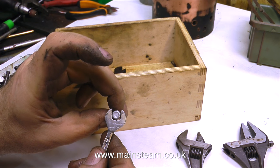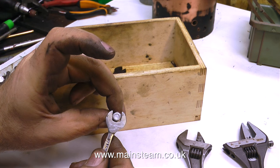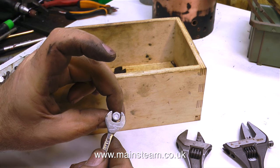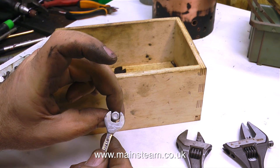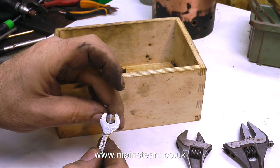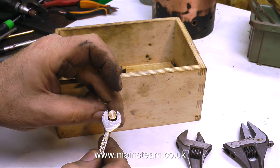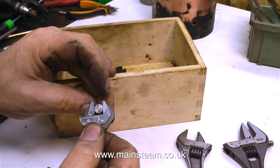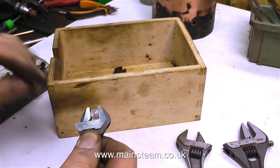The main point of this demonstration is just to outline this: this is a commercially produced — by the million or more — 2BA bolt, and it's a rattle fit in the 2BA spanner. It's not a tight fit at all like the machined one. And of course the other disadvantage is the actual width of the blade on this spanner — it's not as wide as an adjustable spanner blade. The adjustable spanners you get in Christmas crackers are not terribly good, they are really bad.